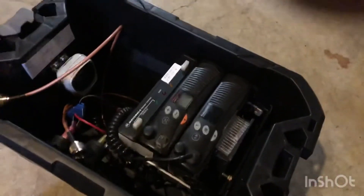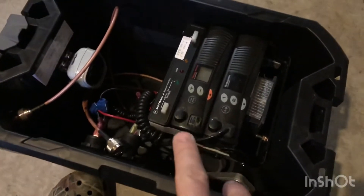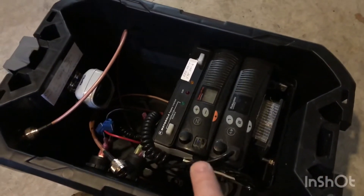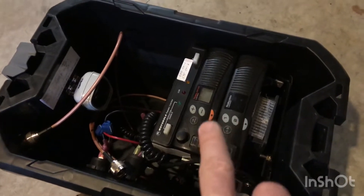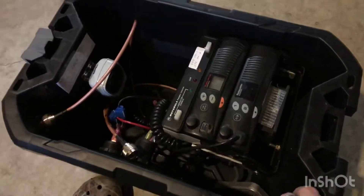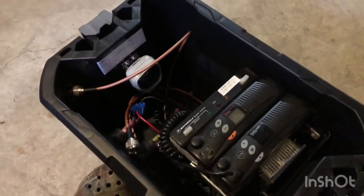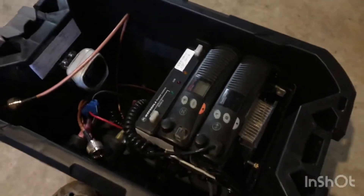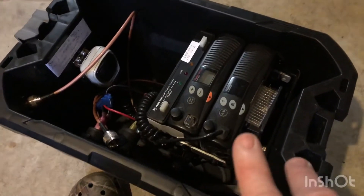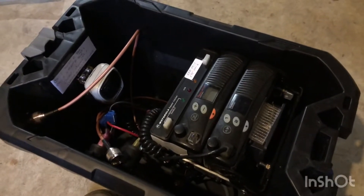I cut way back in software and it's pushing 13 watts. If you run these radios — the MaxTrac and some of the older ones are tanks and make good repeater builds — you definitely want to cut them back. They're not made to be blasted at their full potential at 40 watts, especially for repeater use. It'll just burn the transmitter right up.